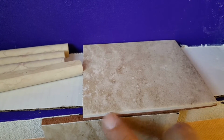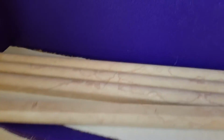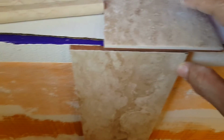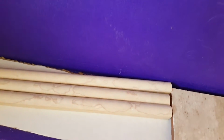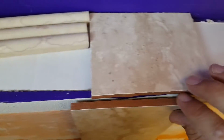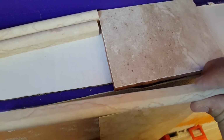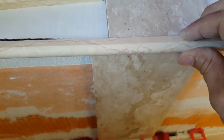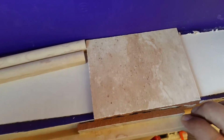Now in this case, since this is ceramic tile and you either have a white edge or this orange edge, what we're doing is we're using these little pencil pieces here to make a frame in the front of it, so that you don't see it. The frame will cover it up. So the problem is now if you have the pencil going right here, you can't have the tile this long. It's got to cut down a little. So we have this other piece over here. You drop that piece out of the way. We have this tile here, and you can see I brought it just to the edge there, because when we put this pencil piece here in front and then allow for that distance of the mortar, let me try to line this up for you, you're going to end up something like this. And it's hard to do it with one hand, but eventually these will all fit and line up. So that sort of sets the distance that you're going to make that tile cut there.